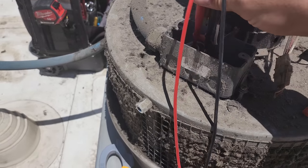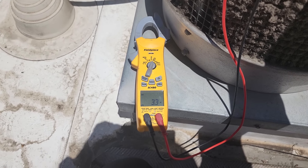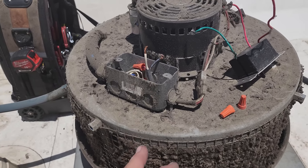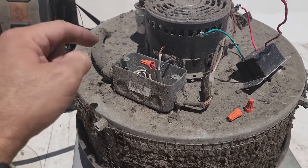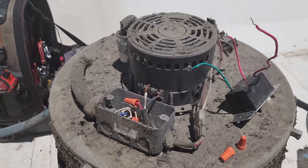We've got power right here. I pulled out the speed controller and we've got no voltage here — three volts. No voltage, and I checked both legs to ground. So our next step is to go downstairs and try to find a breaker that controls the power to this. I isolated the motor so we only have the power in those wire nuts. And if the breaker's tripped, I can turn it on and come troubleshoot the rest of the unit.